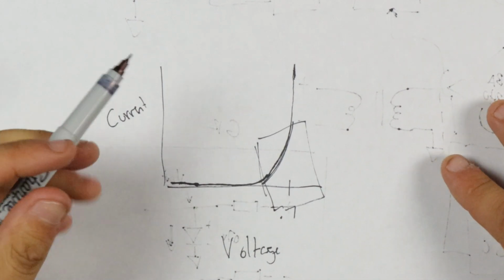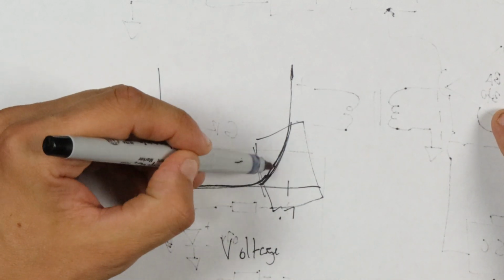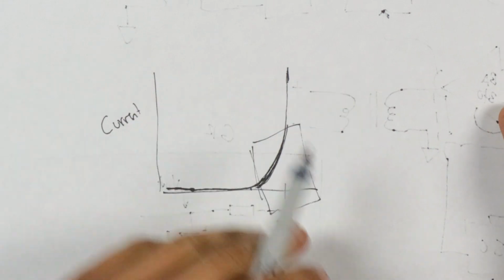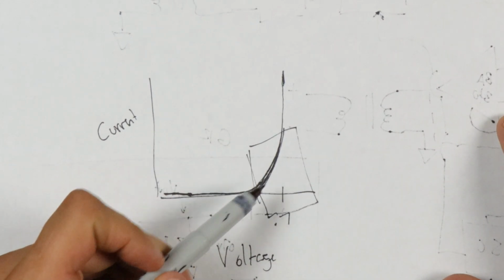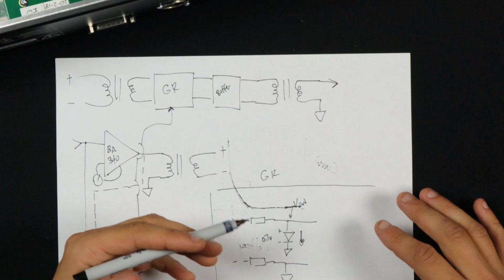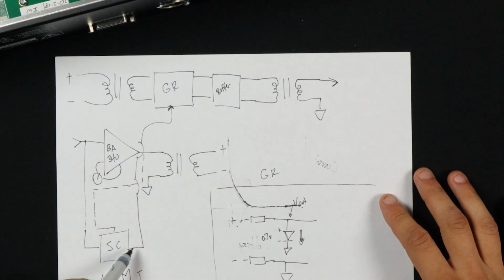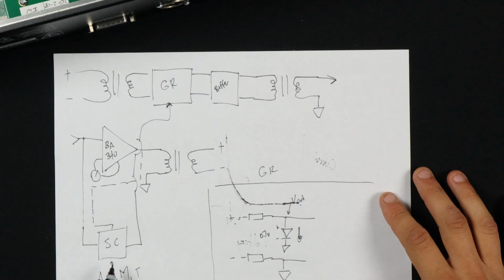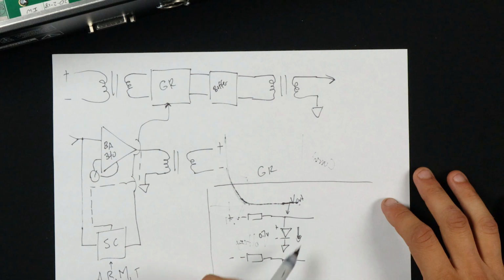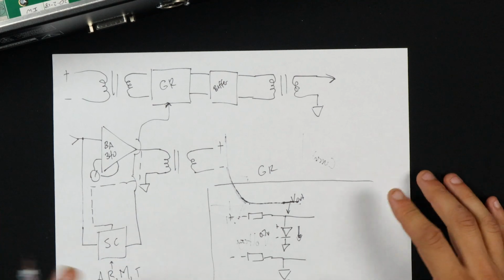And so what he's doing is getting the voltage into this sweet spot and then moving us up and down this little curve here via the DC voltage, via the DC bias on the diode. So it's just so clever that he basically took the natural exponential voltage current curve of diodes, and he's generating a DC control voltage from the side chain here. A very small voltage, because once you go to 0.7 volts, this thing's not a resistor at all. So he's riding a very small little threshold here, which changes the resistance of these diodes. So I hope that makes sense.